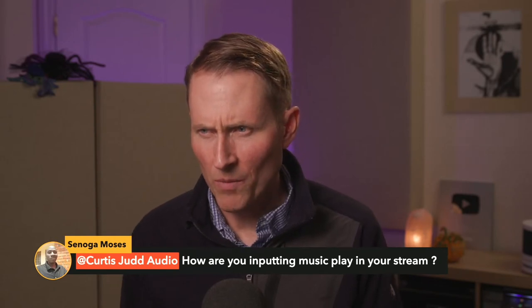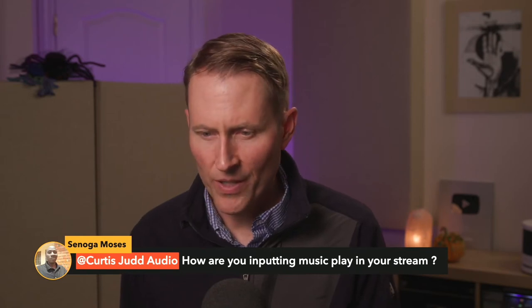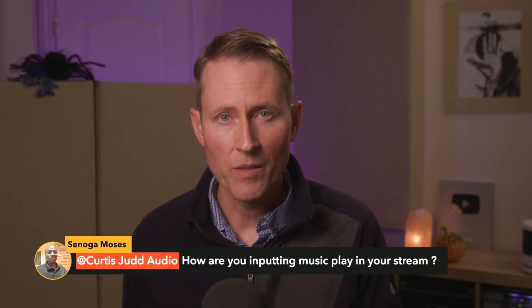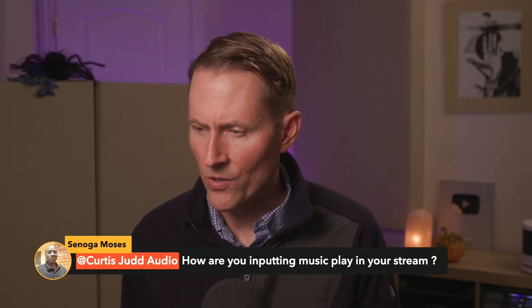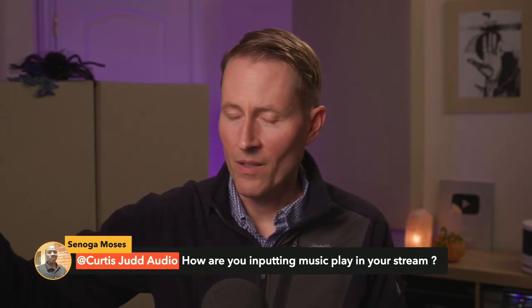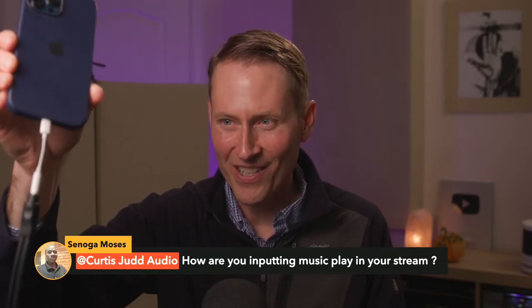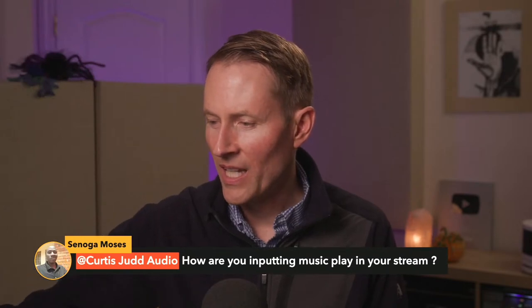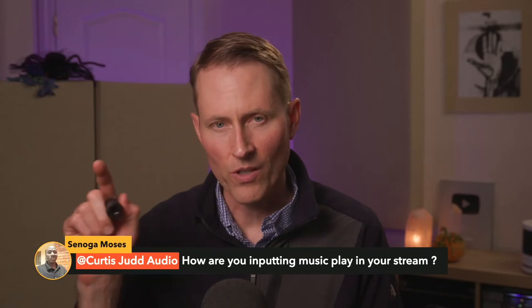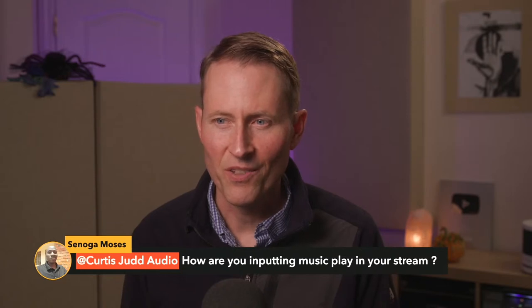Sanoga, how are you inputting music to play in your stream? Generally, what I do is that the ATEM Mini Pro and Extreme have a 3.5 millimeter input. And so I've got my phone here. Because Apple doesn't believe in 3.5 millimeter jacks anymore on their phones, we have the little adapter into a 3.5 millimeter cable, and that runs unbalanced into the ATEM Mini. So that's how we play back the music for the intro and the outro on this. Pretty simple, straightforward. We don't get too fancy on that.